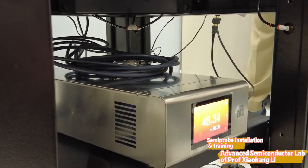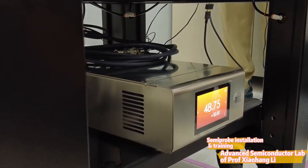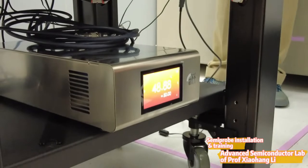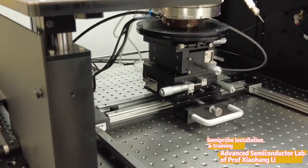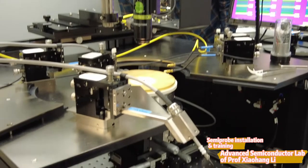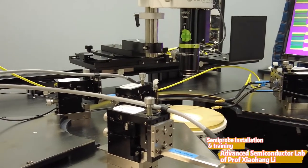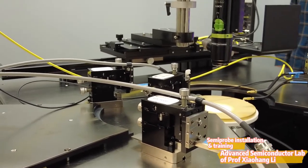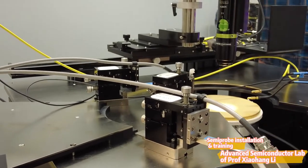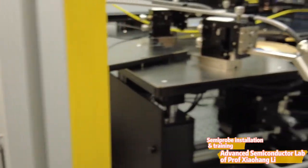This chuck is not a single-layer chuck — it's multi-layer. The sensor is not at the top, it's at the bottom, but it's calibrated to show the surface value. So if it's 45 at the bottom, at the top it will be like 42 — it's calibrated. Try not to touch the chuck without gloves, because you can see the mark. Especially when you put oil or something on it and then heat it up — use isopropyl to clean it.